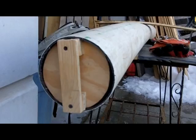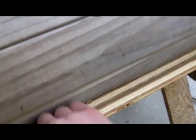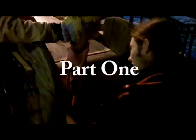That's just a jig we bend the wood around. The ends of the boards go in there. We ended up replacing that with a metal rod though. The metal rods are also used to clamp the boards down in the middle. They go through those holes and we advance them board by board as we put it on. And at the end, they slide all the way through into those holes at the end. This holds the top to the bottom.